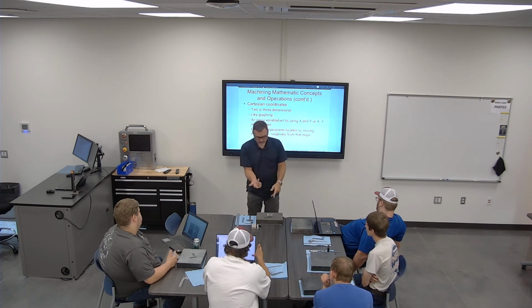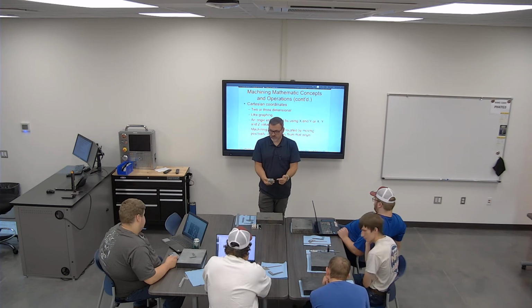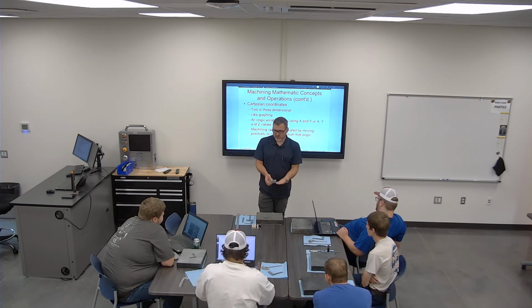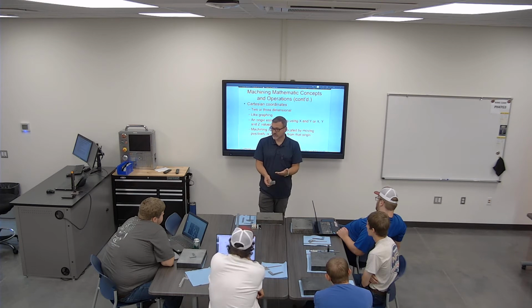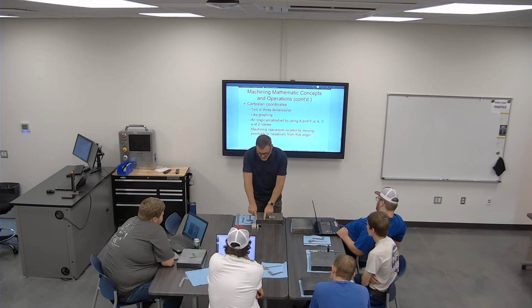Okay, so if I say, when we get to the CNC mills, or we're on a manual mill, and I say X zero, Y zero is in this corner right here, you're going to touch off here and you're going to touch off here, that means everything from here will be positive in X, everything from here would be negative in Y. If the Z is on the top of the part, everything up is positive, everything into the part is Z negative. If it's on the bottom of the part, which is way better, then everything Z is positive. So it's just a matter of where it is. So if I go X zero, Y zero is here, then that means that all of my Y's are negative, all of my X's are negative, and then everything is positive over here and then over here.